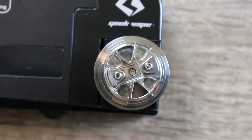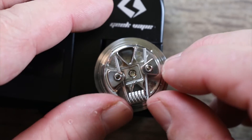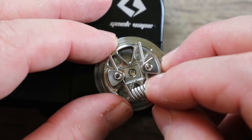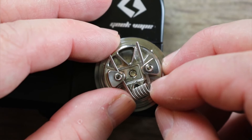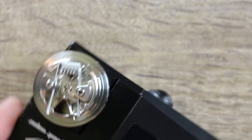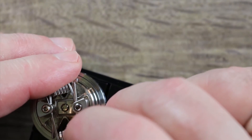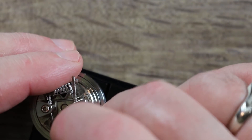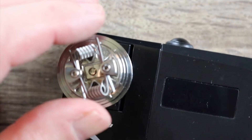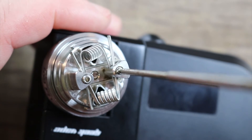Now the way I like to build this thing — I open up the terminals, put my coil in there, and kind of place my coil right at the end of that triangle. That's really where I want to be. Same thing on the other side — I hold that coil in place and just slip my leads in and put that coil right there. Once I've got them placed, I hold them down, get my driver in there, and give it a nice quick tightening.